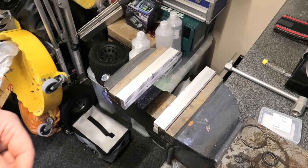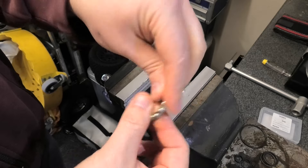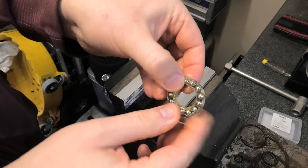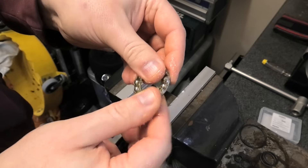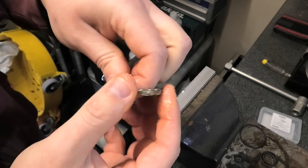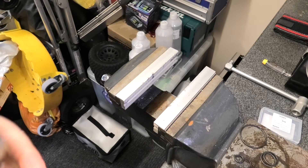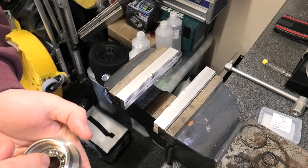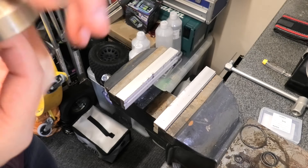Now, taking your main bearing cage, apply quite a liberal amount of grease. These Mossmatic heads don't have grease nipples like the Whirlaways do, so all the grease you're putting in here has to last until you next come to service it. Give the bearings a little roll in your hands to make sure there's plenty in between all the little cracks and crevices — don't put excessive amounts in, just enough so all the balls are well coated. Then take the bearing race and pop it back over the shaft so it sits on the inner race section. Put a little smear of grease on the inside, and with the shaft, put a little bit of lube on the outside so the shaft doesn't catch on the o-rings.